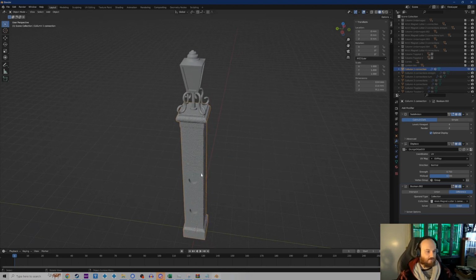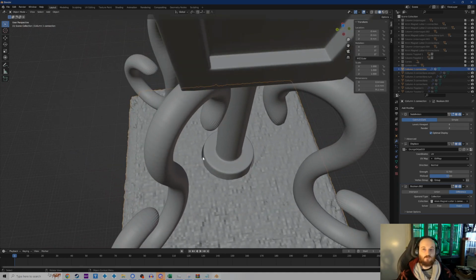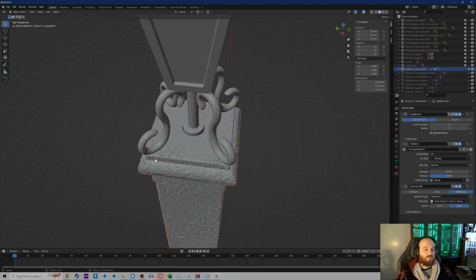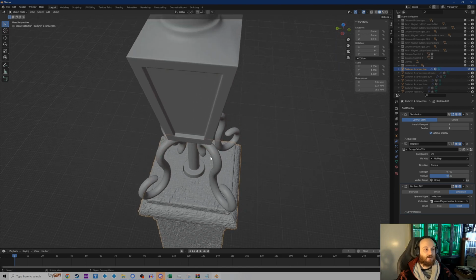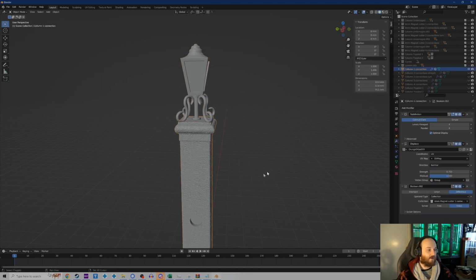There we go. So we now got our magnet holes in there, and if we look in the top here, there's a hole cut. There's a little bit of clearance, so when it prints, it'll be able to slot in there quite nicely, and there shouldn't be any sanding needed. A little bit of clearance for some glue to fit in there as well, and these little divots here will help align it. So that will be much more printable because we can now print it in 2 separate parts.